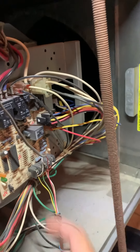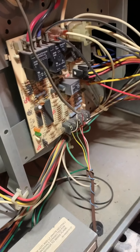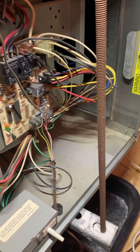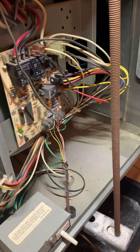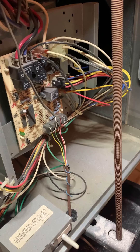A little sidebar: if you ever have two wires, that's going to the condensing unit. See, this goes here, here, here, and it's connected right to the piping. So whatever wire is connected to the piping is always going out to the contactor. This is the common from the transformer — somewhere in the system, from the board. And this is the Y wire. When the thermostat tells you we need cooling, it gives power to the Y wire, which is on one side of the contactor. And the common is always waiting on the other side, and then it starts the unit.